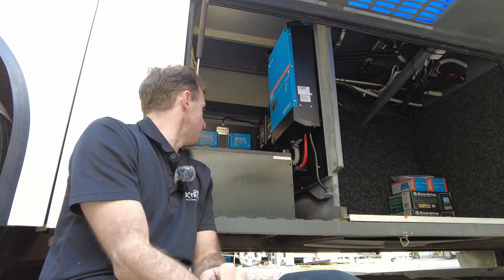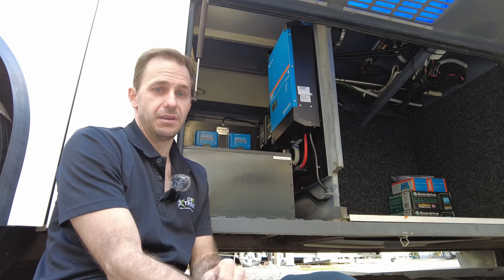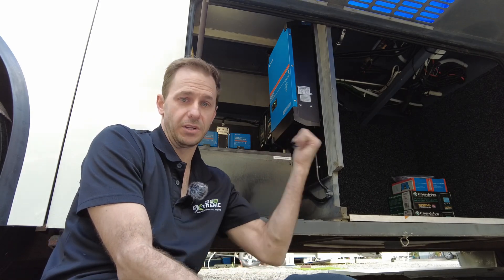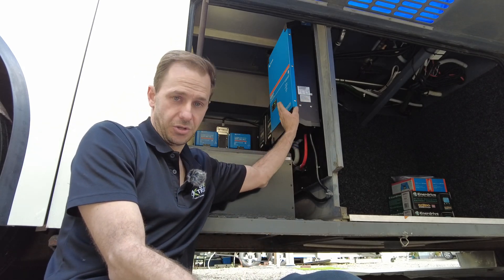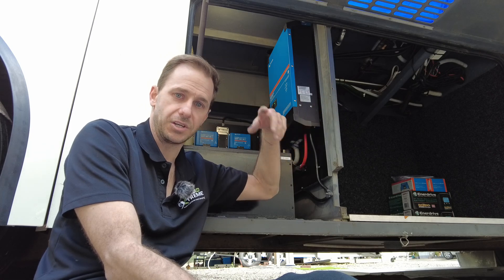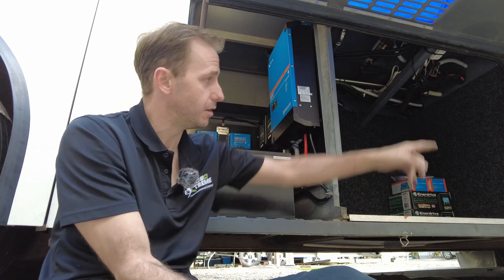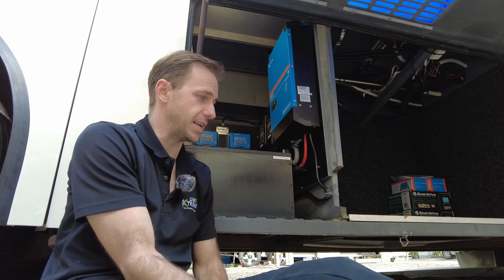It looks simple, and that's my goal — it has to look simple — but this has taken a couple of days with me on my knees. To recap: 2000 watts of solar, 24-volt battery with 840 amp-hours or 20 kilowatt-hours from PowerPool, the Victron MultiPlus II 5000VA 24-volt with 120-amp mains charger inverter running all outlets — two air conditioners, induction cookers, coffee machines, big-screen TVs, full stereo sound system, big washing machine, and a Dometic freezer fridge outside. It doesn't even make a dent.